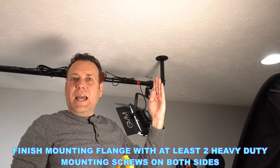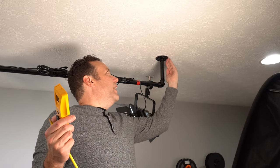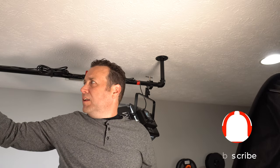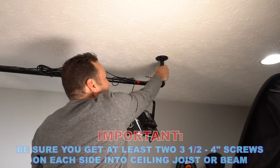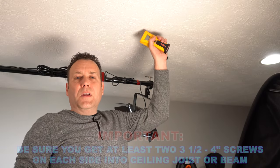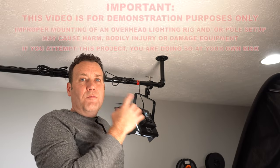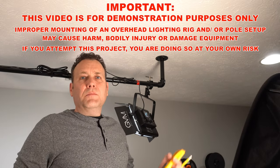You may have to angle a little bit if when you're doing your measurement you're just off maybe a half inch or so. When you're putting that screw in with your drill gun, you want to feel that tension for the entire run of the screw. Once it's mounted, do the other side — you're going to need someone to help you hold it up. Then you need to test it. This is rock solid; I can put a lot of weight on here. If you're going into the drywall only it's going to fail — you want to be sure you're really centered inside that stud. This is a heavy pole of metal with all your equipment on it; if it's not in the stud it can fall on your head, potentially hurt somebody, and damage your equipment.